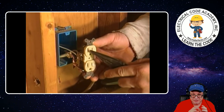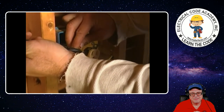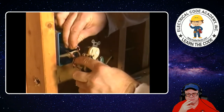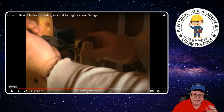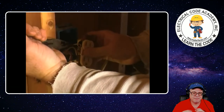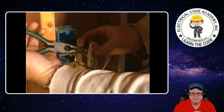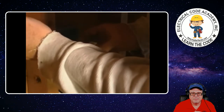Now we're getting ready to hook the white wire — that's why he's probably going to cut away in a minute. The longer slot. Take your pair of needle nose pliers, just go ahead and grab it at the very end and kind of shape it into a J shape. Hook it around your screw here that we've already backed out. Notice how he's got no room to work on anything — he's really cramped up in here trying to force things in. Give yourself enough wire.